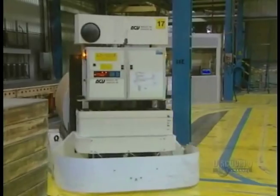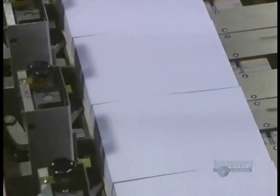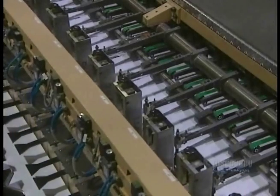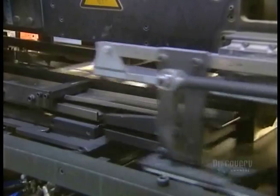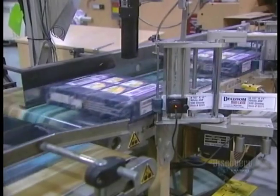Robots guided on rails in the floor feed the Bel-O-Matic paper cutter — the one that produces copy paper. Robots are controlled by a central computer directed by operators. Production reaches 55,000 sheets per minute. Four automatic catchers and operators verify paper quality before packaging. In one hour, this mill produces 6,600 packages of copy paper, and a single log allows for the production of at least 15 packages.